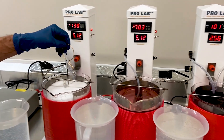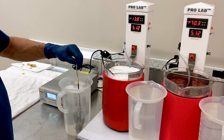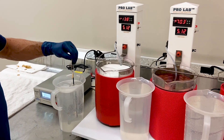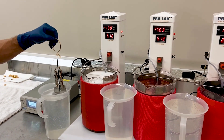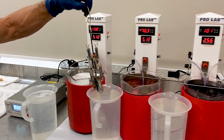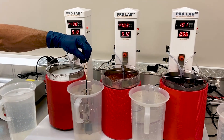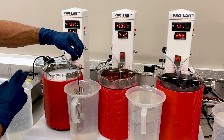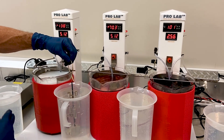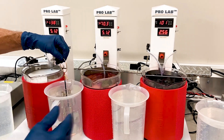That's been long enough for the ElectroClean. I'm going to go into our rinse here, and into the rinse right before the TriVal. So why double rinse? Because we don't want to drag solution from our ElectroClean into our TriVal. In fact, if I were doing a lot of these racks, I would have three or maybe even four rinses.